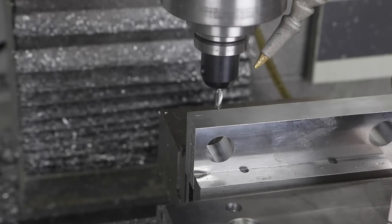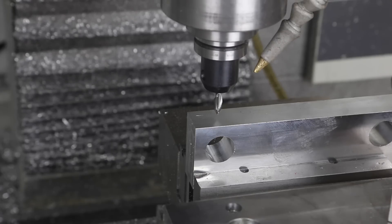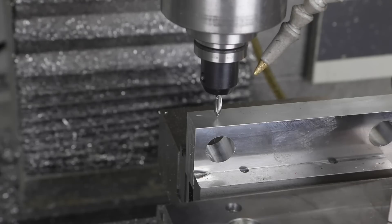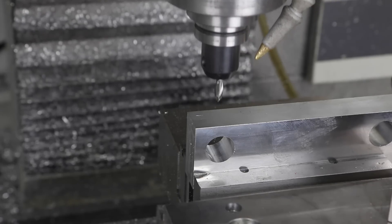We put the part up — it's a two-inch part, we were on a one-inch before. I've got tool 25 in there, I'm just going to jog down. Once I get to Z of one in PathPilot, that should be my Z zero. We're just drilling a through hole here, so I don't really care about five, ten, or twenty thousandths of it being off — it just doesn't matter. I'm at a little over one, so we'll hit Z zero.